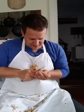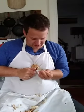So one of the reasons I'm really pushing hard here is that the cell layers that connect one layer of growth rings to the next are more tightly bonded than the cell layers within a growth ring, one to the next. So it's harder to separate one layer of growth rings from the next, which is what I'm doing as I'm carving down here. No, it's not bugs. It's straight up part of the sapwood. It's quite beautiful, really.